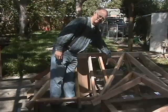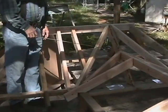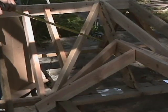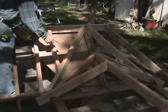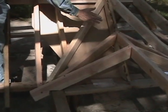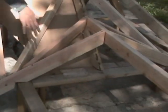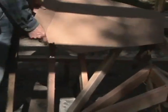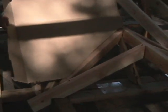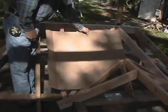On our 12-pitch roof with our 5-pitch roof dying into it, the reason you want to do all this framing is because if you brought your decking all the way down, the problem you'd run into is — let's say an AC guy needs to get from this side of the roof ceiling to the 5-pitch attic area. He wouldn't be able to get through. You'd have to end up cutting a hole anyway, so it's best to go ahead and frame it so someone can get through from one side to the other. When you're framing a roof, you always want to have some kind of an access area.